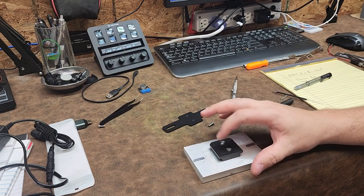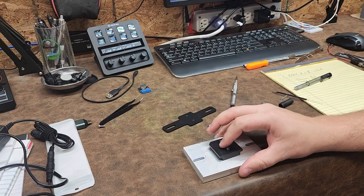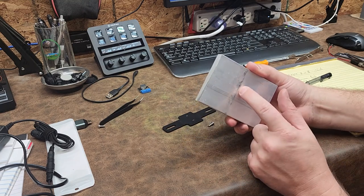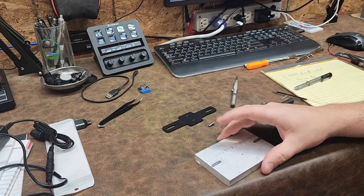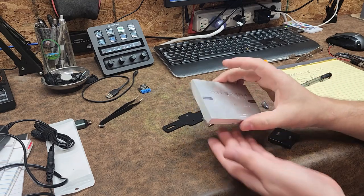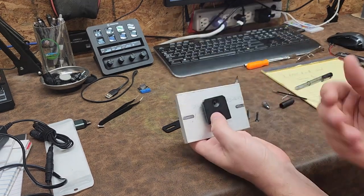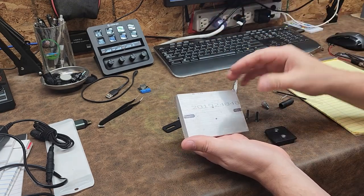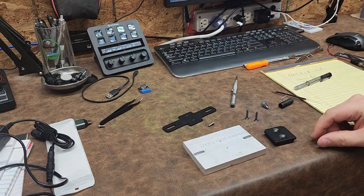We are going to drill and tap and mount this T-slot directly to an aluminum block. Then we're going to finish it off — we're going to put a quarter-20 hole through it, tap it out, and that way we can mount to camera accessories. I need to mount this to a tripod, or to a wall mount, and in order to do that it has to be quarter-20. So this is going to be the entire process.